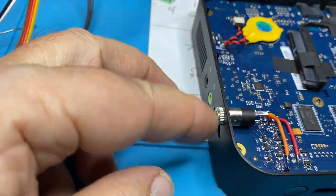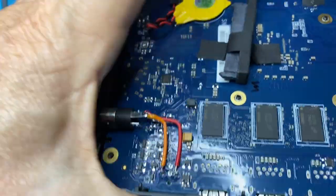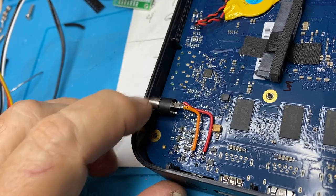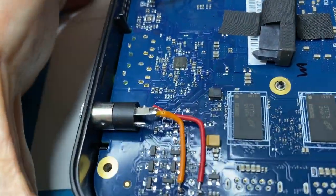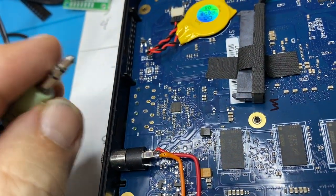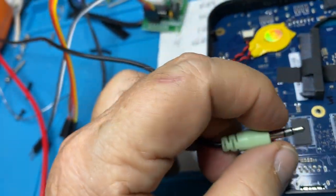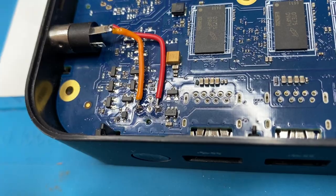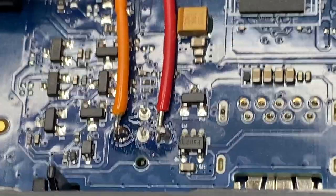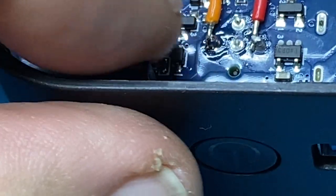What I did is put this connector here, and it fit really tight. I've got it right against the board, so you have to watch very carefully where you put the hole and how much space you use, because the bottom of it just barely fits — it even raises it up just a little bit. I could put a notch in the plastic, but it's not bad enough to bother with. It takes a regular mini plug, and the tip and shield are connected through this. I left off the middle connection. That way you can use either a stereo or mono plug, and it's wired up to the two outer connections on the power switch — those will turn it on and off.